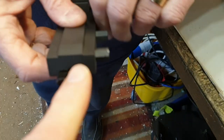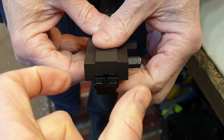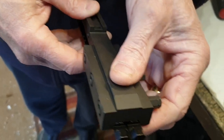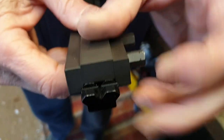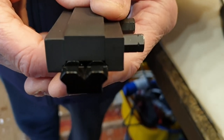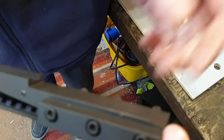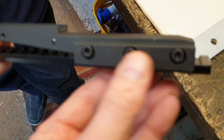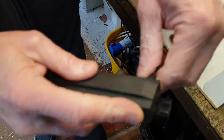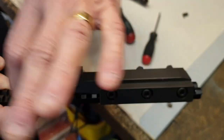Looking inside Kev's mount — exactly the same way. Bruce tried withdrawing and took one of the extra-length nuts off, unscrewed the Allen bolt from one side. At the moment it is threaded for the whole thickness of the mount. There are possible ways Kev could speed up manufacturing rather than tapping all the way through, but at the moment it's very thorough. You can now see it sits perfectly level on top of the rail — no gaps at all. That problem is fixed, and we've got a much longer engagement on the rail clamped by three bolts — very solid.